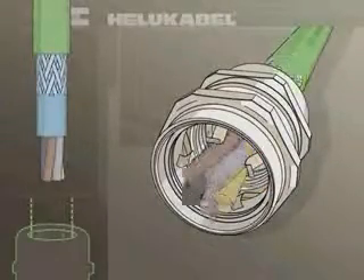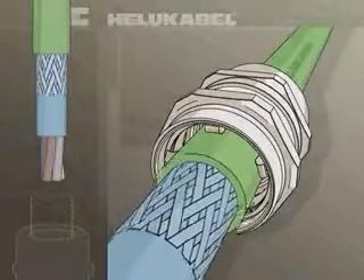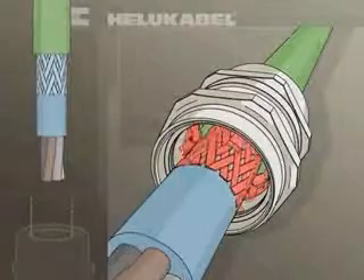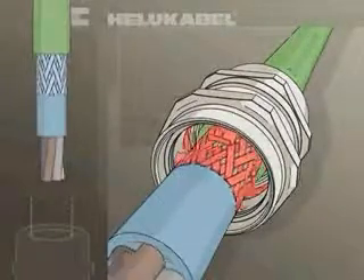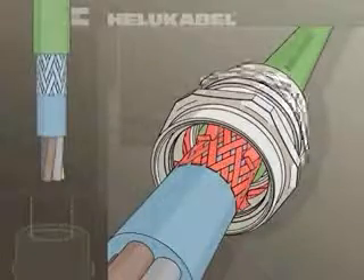There will be an instant contact if cables in the higher clamping ranges are put in the gland. However, the sophisticated design of the glands guarantees unobstructed movement of thicker cables without damage of the EMC shielding.